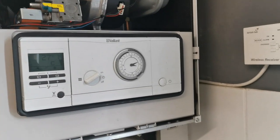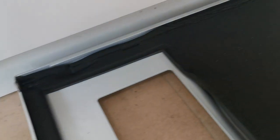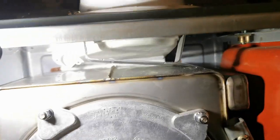Make sure you clean your filters, your magnet filters, and the actual filters on the inlet to the boiler on combis - very important. Flues etc., so be thorough. Check the obvious: stability, location, electrics. Also check that case seal.